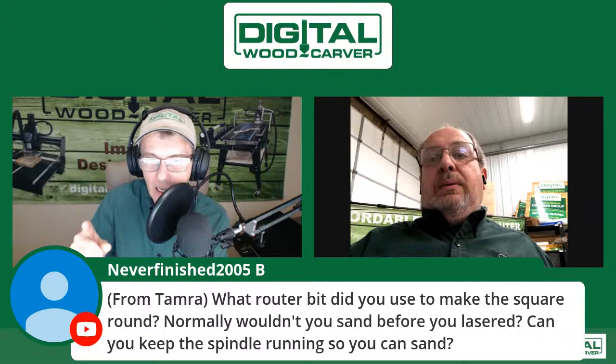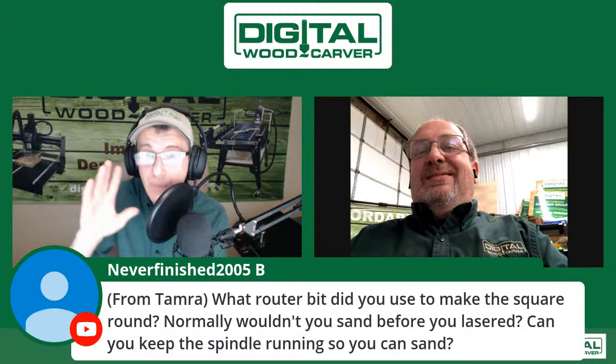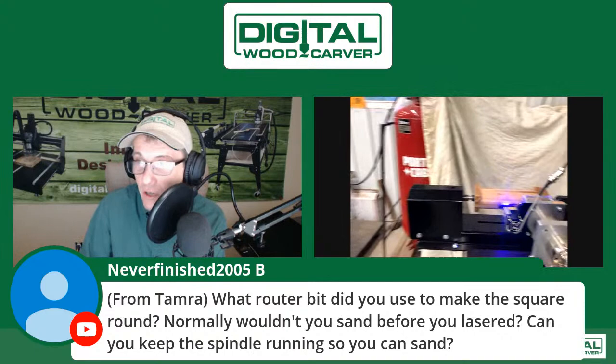The spindle should never be running while you're near the fourth axis, while your hand's near that part. You keep your machine running, but your spindle is off. So great questions. And that's what we're going to wrap up with those questions.